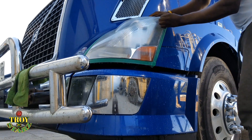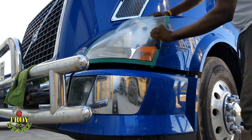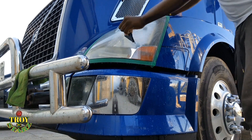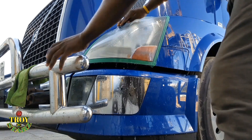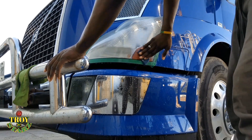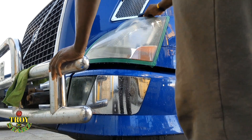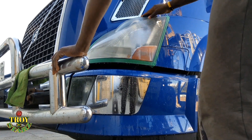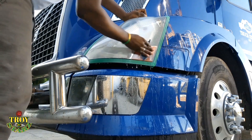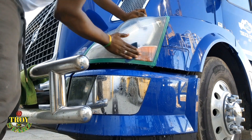It's gonna look a bit dull when I'm finished. If you look closely on the screen here, you can see where it's getting white — you can see the white substance coming off the plastic. That's what the sandpaper is doing right now. It's a wet sand — you use water and you just rub. You gotta spend some time on it if you want the result to look pleasing. You can't rush it — just take your time.